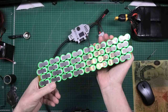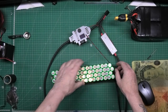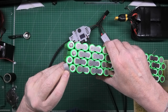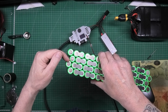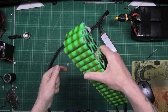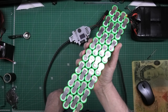When I do the parallel links, I'll put one link on there, one link on there, one link on there, and then I'll take the power lines off the centre between the two so I can spread the load — rather than just taking a tap off the middle like most people do. It just spreads the load out. All of these have got to be paralleled up, every single one — so it's going to take a while.